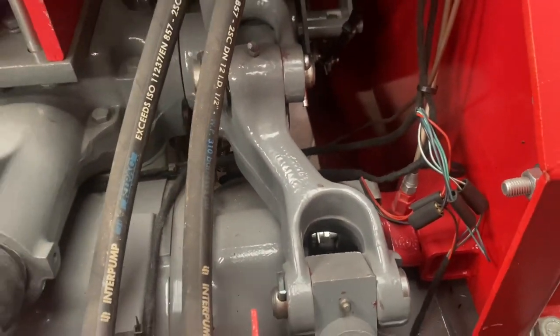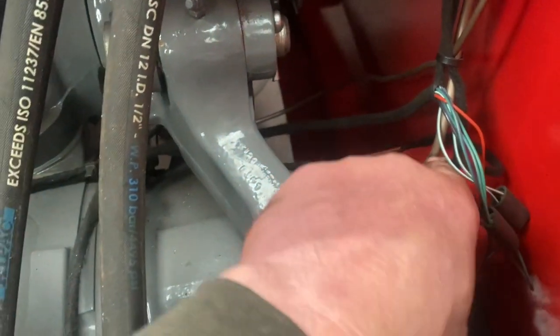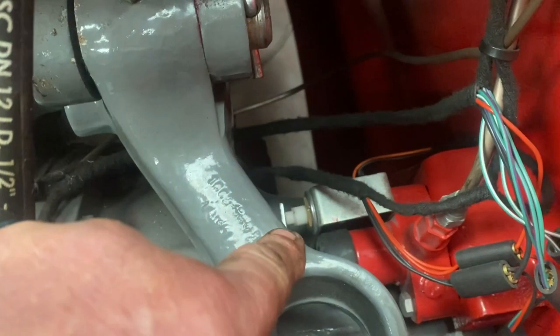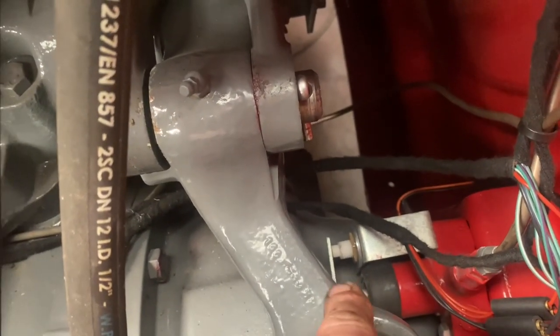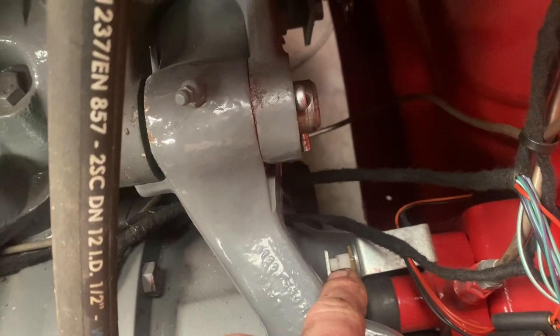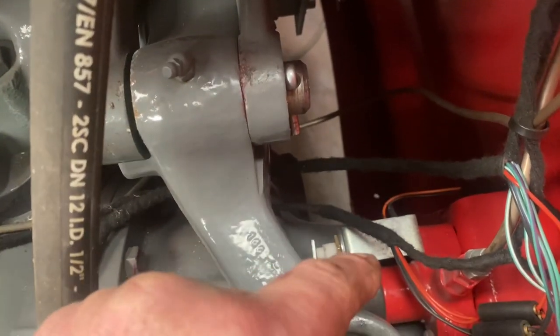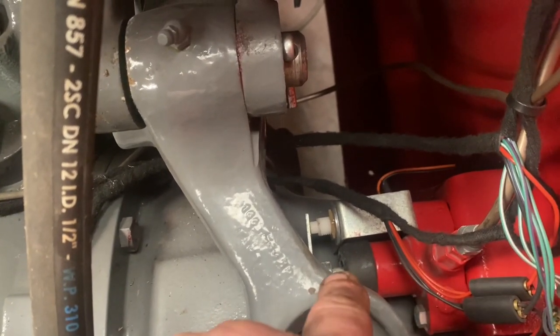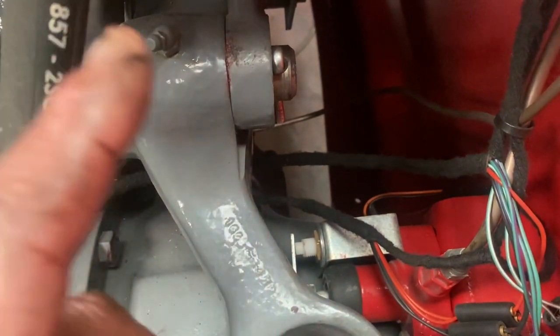In reply to Father Phil and Farmer Phil, they're talking about their 1200 the other day with the diff lock and the link arms. I'll show you how it does work. This is on the 1250, but predominantly the same as the 1200, other than it is plumbed up differently for the actual supply for the hydraulics. We have a valve here which is supplied by oil pipe, and the switch they're on about — the little white one there — is just a warning switch. So when the diff is engaged, obviously that little plunger comes out and engages the diff, which then the switch there, which is switched on earth, will then trigger the light on the dashboard to say that the diff lock is engaged. When you take your foot off the pedal, obviously the valve releases, the oil goes back, the valve returns on the spring, pushing it out, then the switch goes to open circuit and the light goes out.